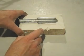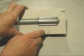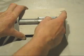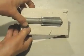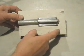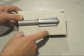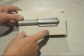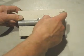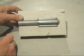Now the important bit that's come up, you noticed, tilted over a bit, these are aligning dowels. The idea is to make sure this is thoroughly lubricated so it'll separate, but also when you put the plaster on top, it will fill up those holes and will give a perfectly matching top half and self-align.